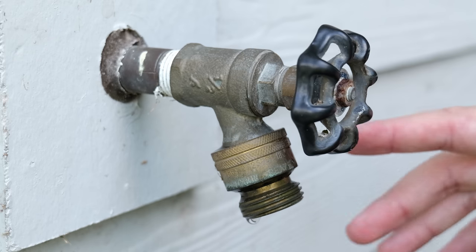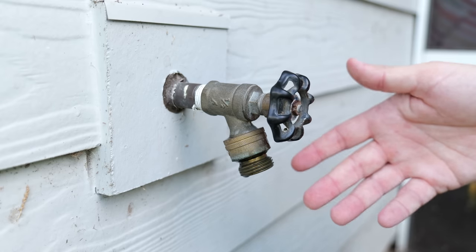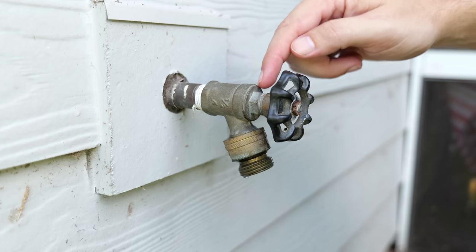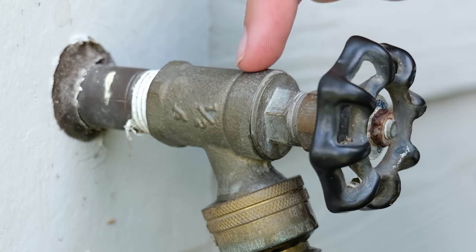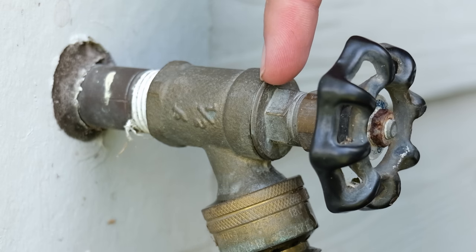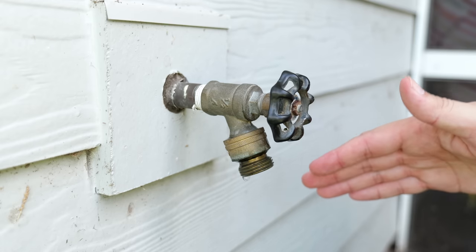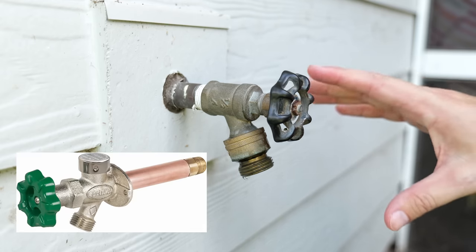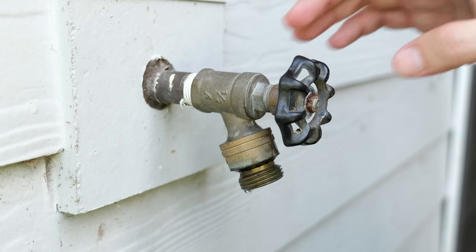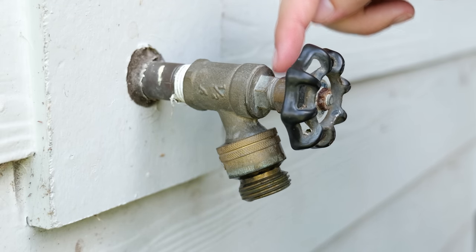A fix that will work a lot of the time, but is more of a temporary fix to buy some time before a more permanent fix or hose bib replacement — if you look really closely you'll see right here where it looks like the shape of a nut. That is where we can put an adjustable wrench. There's a little crack between the front of the faucet and just barely behind it — this is the opening for the housing. Different faucets may have different locations for their housing, but pretty much every faucet will have a removable cap to access the housing, and a dead giveaway is looking for somewhere that looks like a nut.